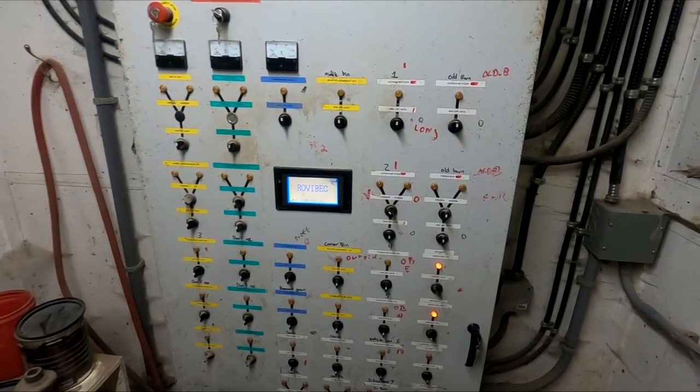All this bigger stuff is from this conveyor, which had a hole in it in the middle. It was just tossing feed off and off and off. So we replaced it. And now what they're coming to do, if you guys can see in here, hopefully. This conveyor that's up here, it's really dark in here. Sorry about that. They're gonna shorten it about 6 to 8 inches because this conveyor is throwing the feed too far and a lot of the feed is just falling off the conveyor and landing into the stalls in here. So we're gonna fix this problem also because this is a lot of wasted feed, a lot of money sitting right here. So we're gonna flick all these switches on and then make sure everything's running good.